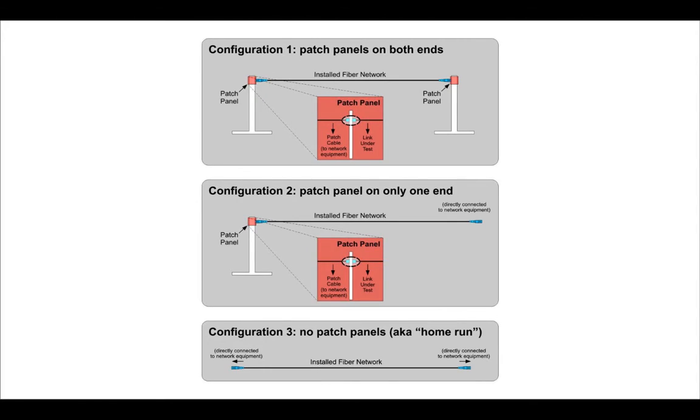Here are some diagrams showing three different link types. Multimode fibers contain hundreds of possible paths called modes that carry optical signals from one end of the fiber to the other. Low-order modes tend to travel near the center of the fiber core and remain in the core for the whole length of the fiber. High-order modes, on the other hand, tend to travel near the core-to-cladding boundary and will be lost in the cladding before reaching the far end. To decrease uncertainty, high-order modes should not be included in the optical reference. Unfortunately, a one-meter reference cable is too short to remove high-order modes on its own, which is why cabling standards typically mandate that multimode reference cables be carefully wrapped around a smooth, even cylinder called a mandrel. By wrapping the reference cable this way, high-order modes are quickly forced into the cladding, leaving only low-order modes.